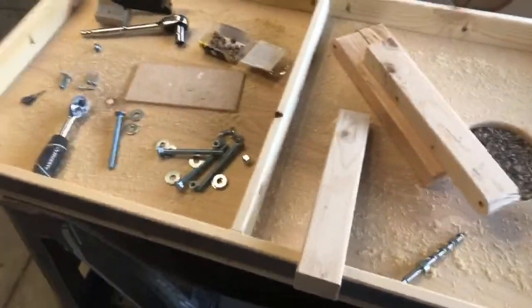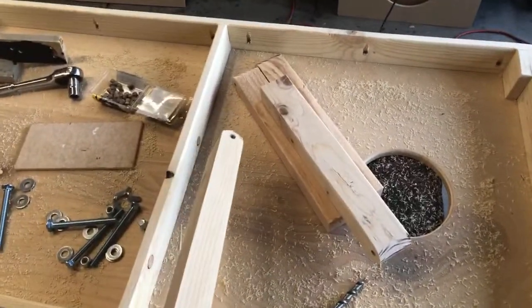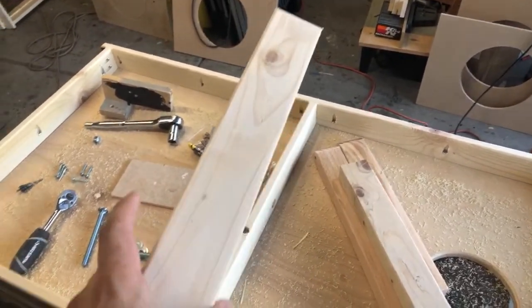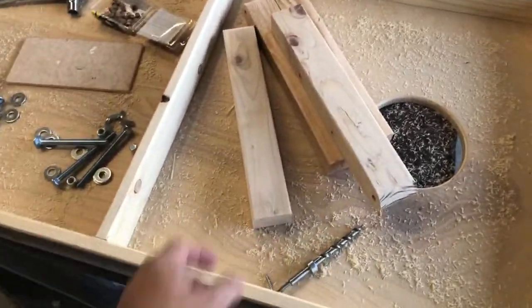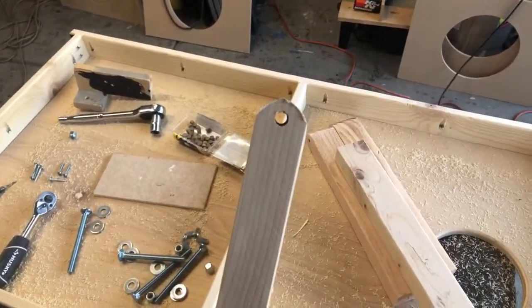These are the things that I like to use. There's a lot of ways to build legs, but I make my legs out of 2x3s, and then I clean these up a bit. I just run them through either the table saw or I sand the finishes so that you can get any stamps off of there, clean them up a bit. So we got four of those. They are cut to 14 inches, just square on the ends to start with. And then we drill holes through them.